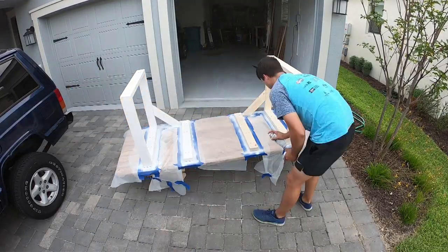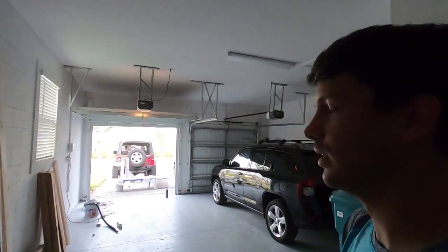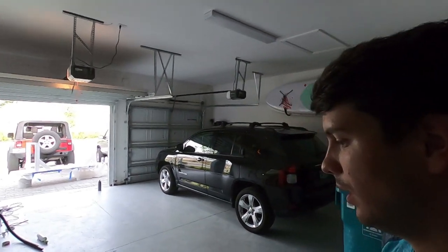All right, that's coat one done. Now I gotta take a real high grit, sand it, because it raises the wood grain a lot, but it's not too bad. You just sand it, and it gets really smooth really fast on the second coat. And you do a third for fun, or to even it out, you know. Sometimes the wood grain shows through, so. I say so a lot.